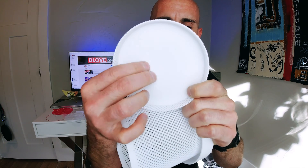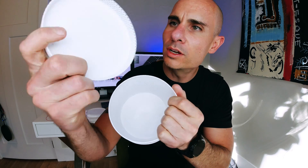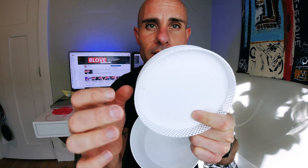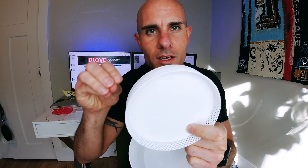Now what I can tell is the surface quality. I actually don't think the surface quality on the 0.2 looks as good on the top layer. The other thing I noticed with 0.2 millimeter — and I probably just need to tweak it more, but I'm not going to because it's so painfully slow — is that the 0.2 millimeter actually had a lot more oozing. You can see all these globs underneath the top layer where the filament built up on the nozzle, burned, and was deposited on one of the infill pieces.